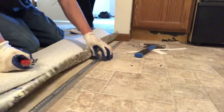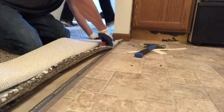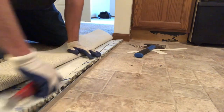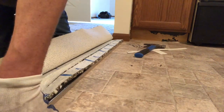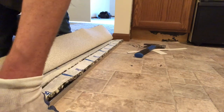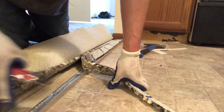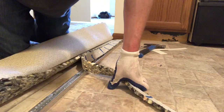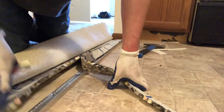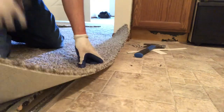We've got this down and everything's good. Go ahead and trim the pad up to it, just a hair behind it — nothing too crazy. If you go too far back, there will actually be a dip when you do the install, and you don't want that. Just cut the pad back so it's just a hairline short of the teeth of the metal and you're good to go. If you have any questions about the carpet and flooring industry, throw that comment down below. As always, I truly appreciate you tuning in — thank you so much, and I'll see you in the next video.